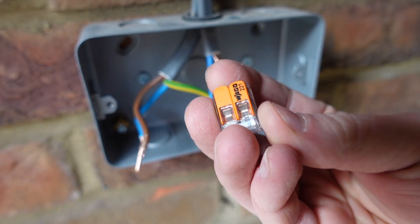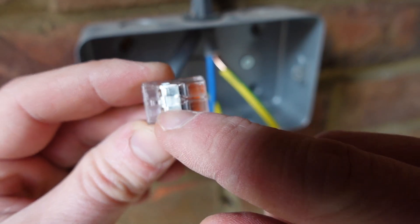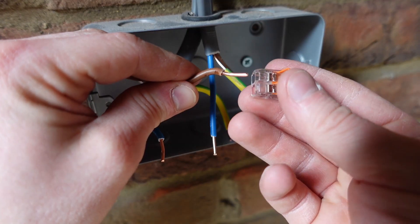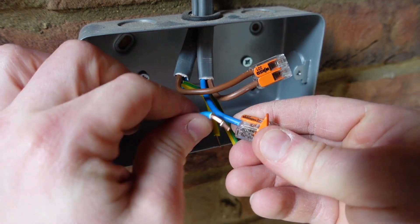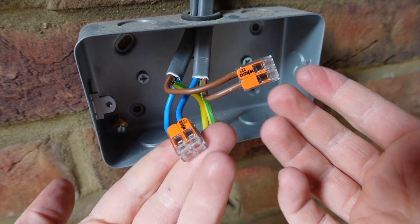For the same reason as the wire strippers, I think these actually up the game with safety. You can get a few different types, but the best ones are these clear ones. They're really good for the DIYer because they make it less likely that you won't insert the cable correctly — you can actually see to check that the conductor is all the way home. Just flip up the little levers, push the cable in, flick the lever down, and you can see that connector is not coming off. You can see how quick and easy these are to use, and they eliminate the chances of error — therefore they're a lot safer for the DIYer. We've barely touched the surface with DIY electrical — check out one of these videos here because they'll teach you a whole lot more, and I'll see you guys in the next one.